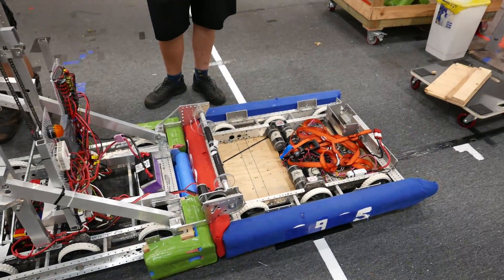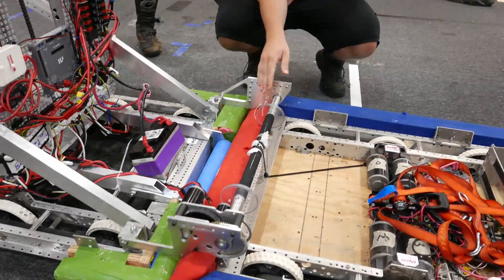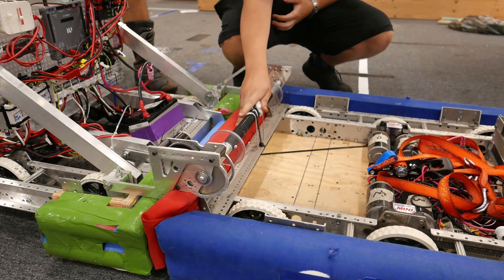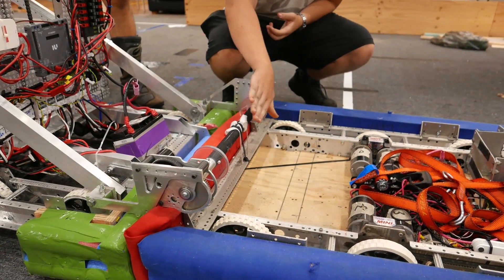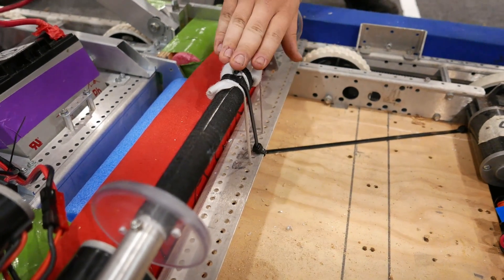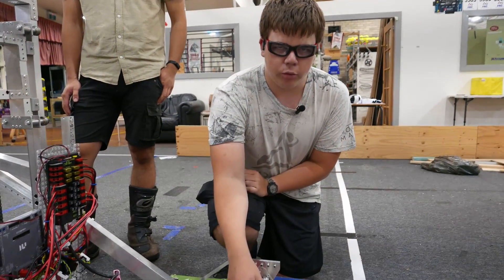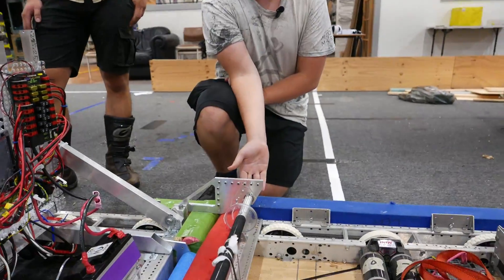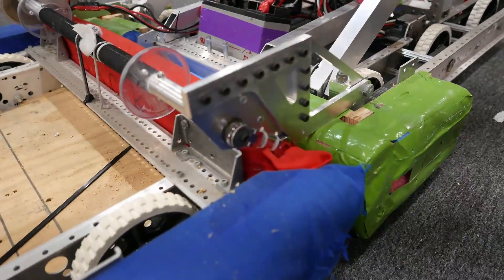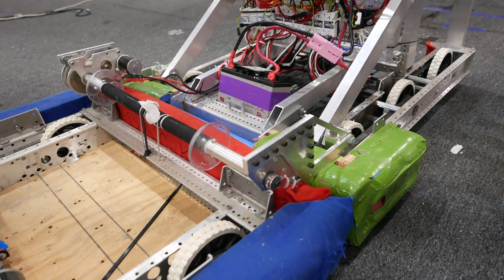Since your center of gravity can be anywhere, why not hang another robot off the back? So here we have our patented Robo Wrangler. We have a gearbox on this side driven by two bag motors, driving a shaft covered in velcro. We have two velcro tags on the end of a loop of rope, so the velcro gets stuck to the shaft and then gets rotated around, wrapping the rope really well. On this side we have a ratchet — just a normal ratcheting spanner — which stops the robot unwinding as we go.